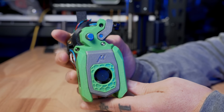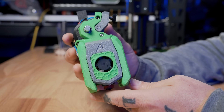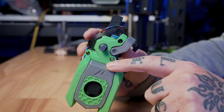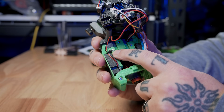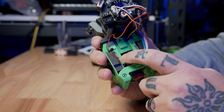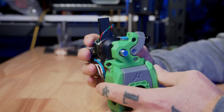The Ant Head is a really nice looking little toolhead. It takes a lot of styling cues from the newer Micron R1 styling — kind of a low poly look. There are no holes through the front for the toolhead mounting screws; those are actually hidden behind the gray part. Looking at the toolhead from the back, you can see the modular parts and the screws that attach it to the carriage. You start by attaching the hot end mount to the carriage, then the main body goes onto that, and then you can screw the ducts onto the sides and finally install your extruder.